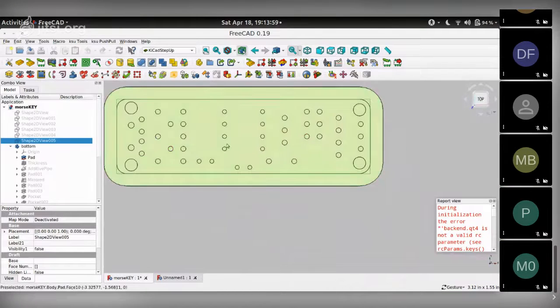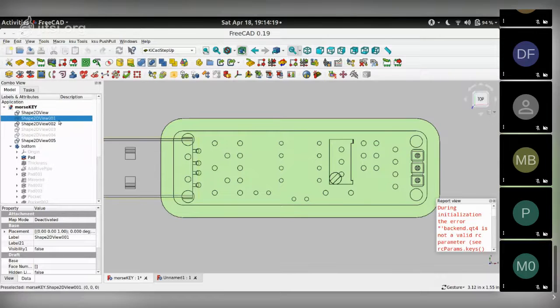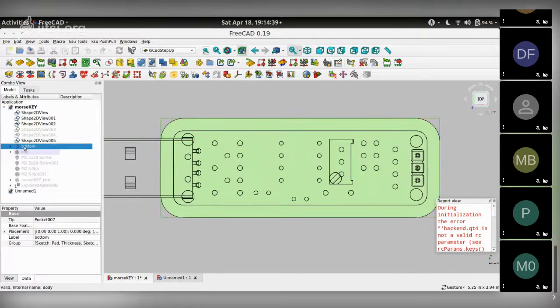This, which is essentially the PCB and all of its components and mounting holes. So you can use these references to figure out your actual case design. So these are the essential things. We need the PCB with its holes and mounting holes and stuff like that. We need the USB connector, the potentiometer, and the 3-pin header for the Morse keys. So let's look at how to get these first before we even start making the case layout.